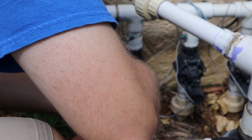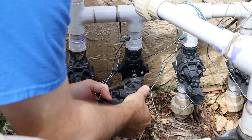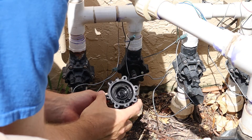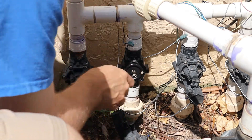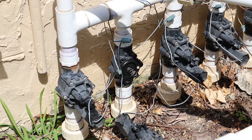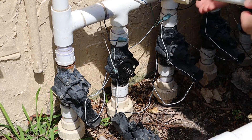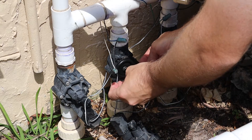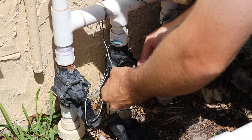You can actually get rebuild kits for them at Home Depot — I think they're about four bucks or so. Let's take this diaphragm out. Let me get you repositioned so you can see what's going on here. So this piece right here, this diaphragm, comes off. I'll take this out and see if we have any tears or anything like that.